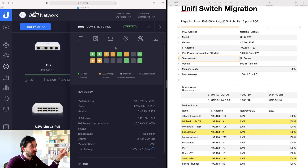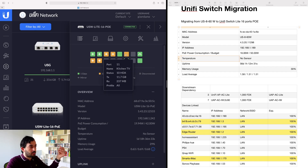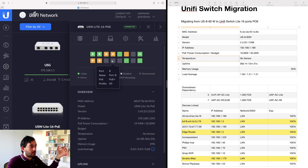You're going to need to put your uplink in port 15 — my uplink is my USG router. Think about which devices need PoE and which don't. Devices that don't need power should go between ports 9 to 16, excluding port 15 which is your uplink. All your PoE devices need to go between port 1 and port 8. It doesn't matter which port specifically. At the moment I have six PoE devices powered and two free empty slots for future expansion.